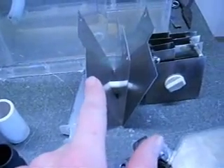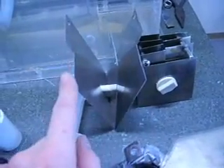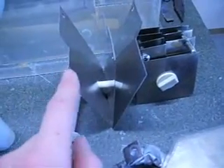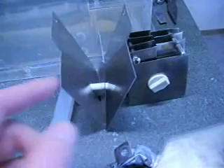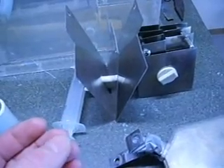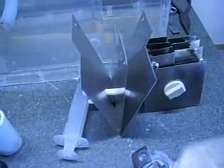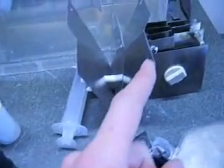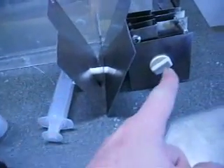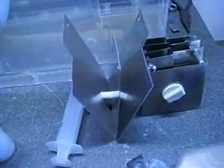More specifically, with the plates themselves — imagine you've got three plates, and these two outside plates were negative and this centre plate was positive, regardless of whether there are any neutral plates. The original theory was that having two negative plates and one positive plate would potentially produce more hydrogen, because the hydrogen bubbles seem to form on the negative plates. But when you think about it, it really isn't true at all, simply because you've got two surfaces of negative and two surfaces of positive — the outside surfaces don't generate any gas. So no matter which way you have it, you've got two of one and two of the other.